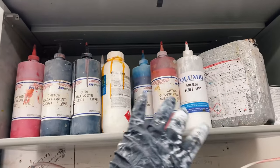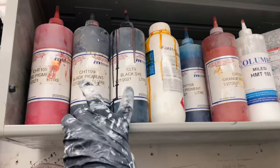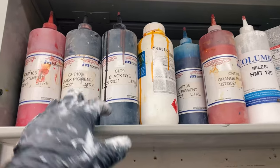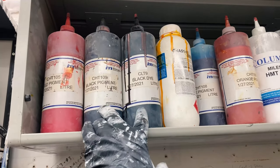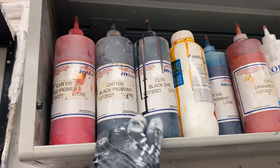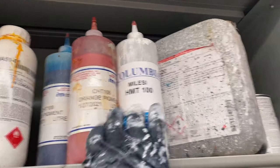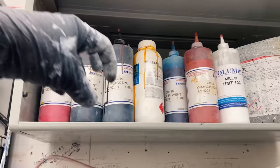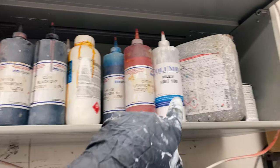These are just a few of the colorants that I have — the basic ones we use. We have black dye and black pigment. They're different because of the way they work: dye goes deeper into the grain, while pigment stays more on top reflecting the surface, giving a more uniform finish. The colors themselves are also slightly different — this one is more of a dark greenish-bluish black, this one is more of a neutral black. This is red, yellow, blue, orange, and white. And this is the binder — basically glue — something that makes your pigment stick to the surface and doesn't let it slide into the grain.